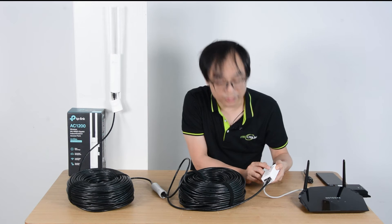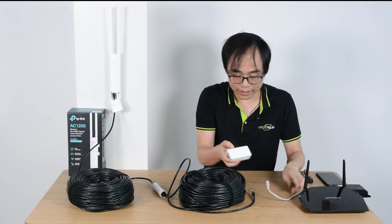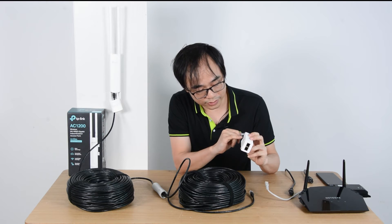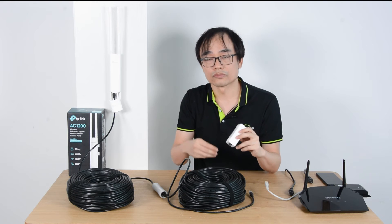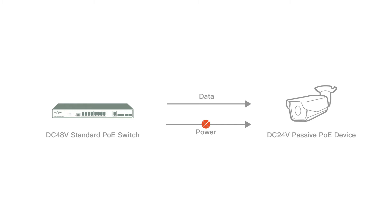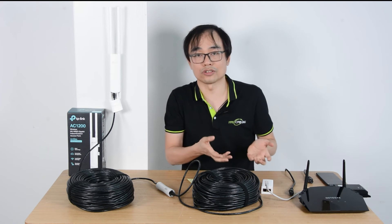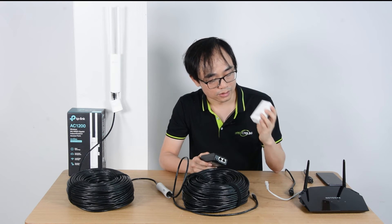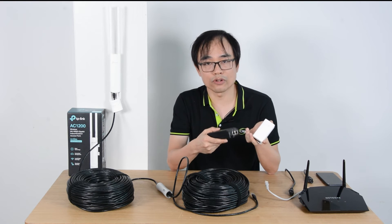This is a passive PoE injector. The one from TP-Link is not standard PoE — that's the problem. For passive PoE, it uses DC 24 volts. But in standard PoE, the voltage is 48 volts. So there is no solution for repeating passive PoE because it is not standard. The solution is we need to replace the TP-Link injector, since it uses DC 24 volts and is not a standard unit.